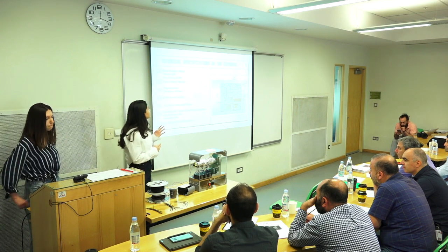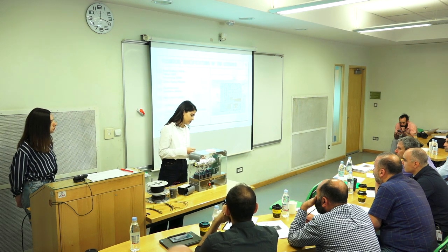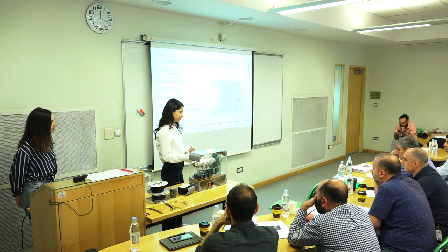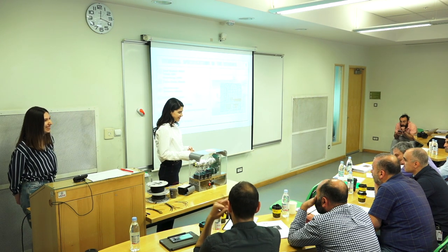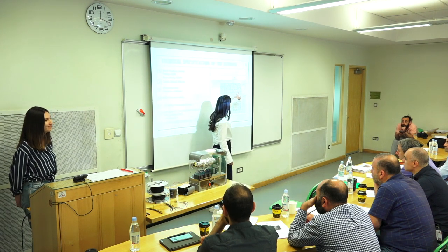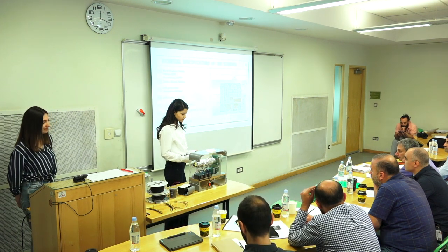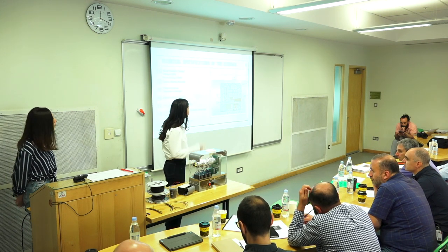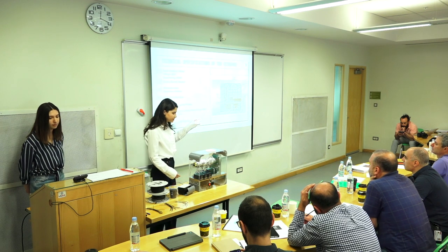Now let's talk about the technical specifications of the extruder. As you can see, our main part is this. It is not visible here because we insulated it with fiberglass material with the help of our friend Alex here. The insulation was needed because the barrel, you can see it here, and these heaters produce high heat, and we wanted to insulate the material in order to avoid overheating the electronic components available here. So we have three heaters, the barrel, and the screw inside the barrel.